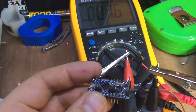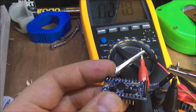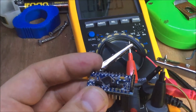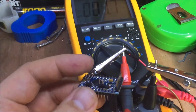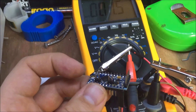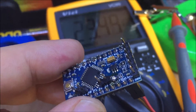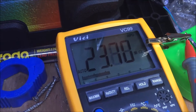I've got a direct short between VIN (raw) and ground on this one. I'm fairly sure it's that capacitor that's blown up, so I wonder what will happen if I just remove it. I have just plugged this in via USB and it powers up and runs the sketch quite happily. That's gone and that's looking a bit better.